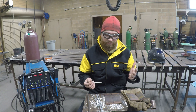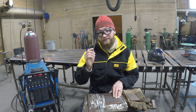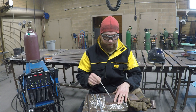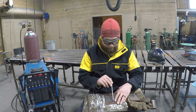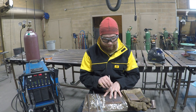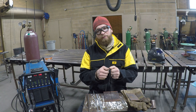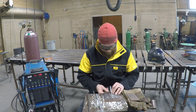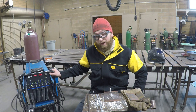When we set this butt joint up, because we're using 3/16ths plate, I want to put a gap that is 3/32nds wide. So I grab a piece of an old electrode from a bucket and make sure that the bare end of the electrode fits all the way down. I don't want it to wiggle, but I want it to slide in just nice. You can also squeeze one side of the plate. You can even bend these electrodes so they stay put and don't move around. I'll put one electrode right here and make sure that gap is nice and tight — the flux will keep it from going one side to the other.